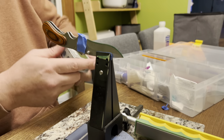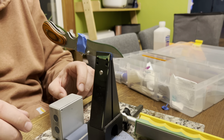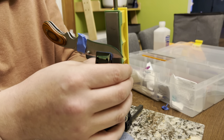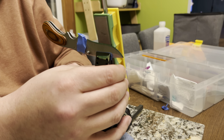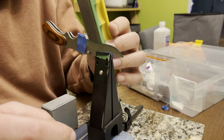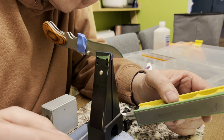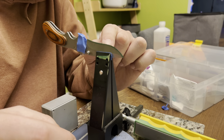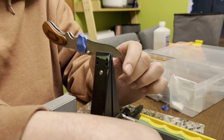We'll grab our angle cube here and get any little metal shavings off the bottom. I'm going to zero it on our base and see where we're starting on this side. That is 15.8 right out of the gate. So we'll do a few passes here and see where it rubs off the marker. Kind of what I expected — I'm barely touching the edge down here, and right through here I'm hitting the entire bevel, and then all the way along the back I'm hitting the shoulder of the blade. So it's wonky as hell.